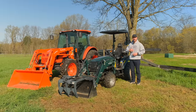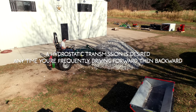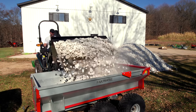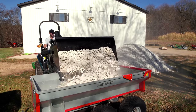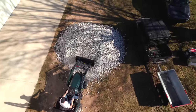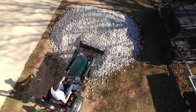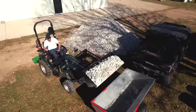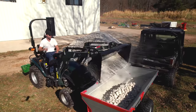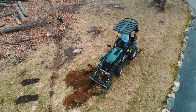You can't get anything easier or more efficient to operate than a hydrostatic transmission. Whether you're just trying to hop on and go, it's super easy. But if you're trying to do work with the front-end loader or the three-point hitch, you're not worried about pushing a clutch in, selecting the range, selecting the gear, making sure you're going forwards or backwards — all those handles, levers, and knobs. If you want to change speed, all you're doing is controlling your throttle, making those engine RPMs go up or down, and pushing that pedal hard or just a little bit to speed up or slow down.